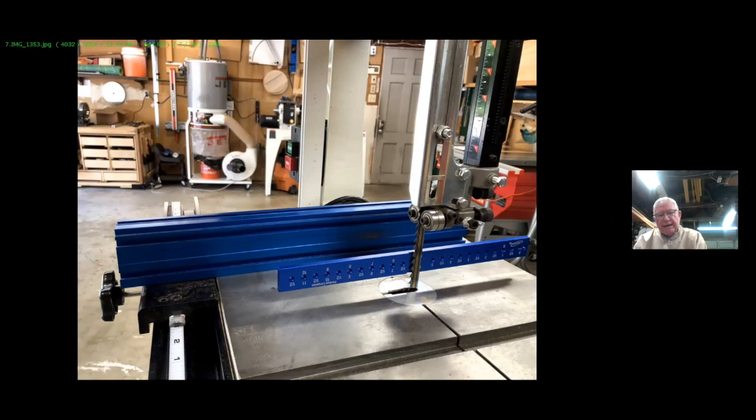And before I had that, I've used it quite a bit to cut stock down or resaw stock to half size to make smaller rings, segment rings, and that sort of thing with it. And it was a real struggle. It tends to walk away from the fence either on the leading edge or the trailing edge. And pretty soon you've got a wowie in the cut that you've made that's only a 1/16 of an inch, but to get that out, you've got to take a lot of wood off or do a lot of work on the jointer as well.